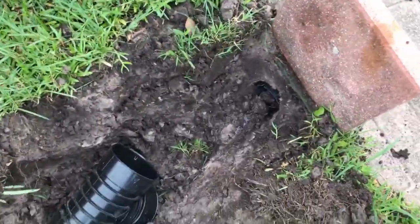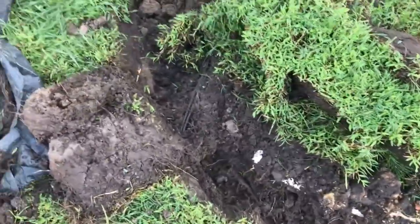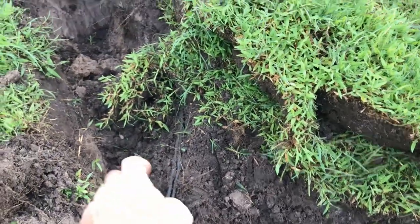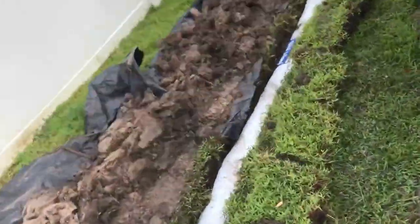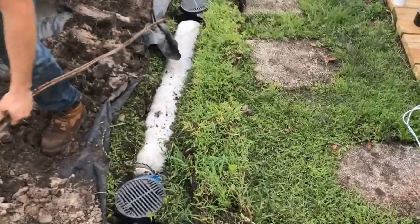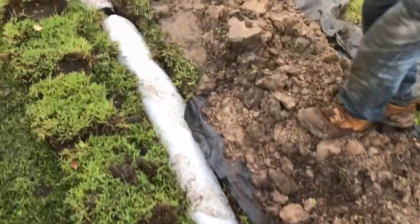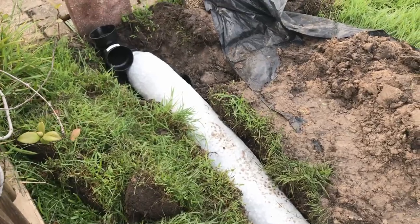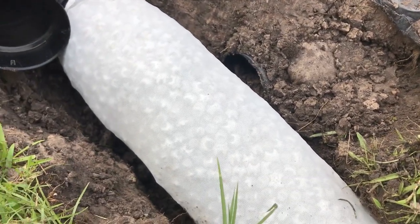We're almost done digging. We're going to attach a T to this line coming from that catch basin — you can see the pool return line right there. Just had to widen the trench. There are some unmarked cable lines down there; we'll go around and under those. We just laid out the easy flow and put a couple of catch basins in the low spot. We're going to start backfilling. The easy flow comes around here, we're connecting the catch basin to the easy flow, and also to the easy flow running in that direction — that's our existing system running downhill to the sump basin.